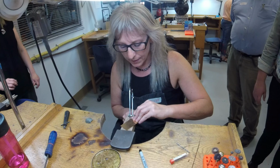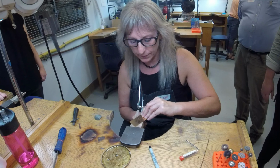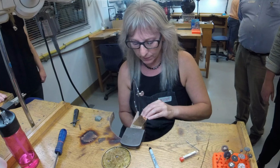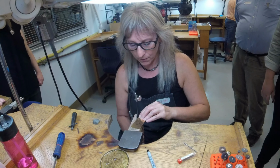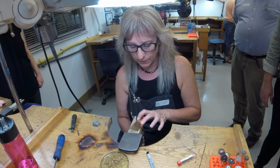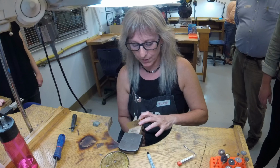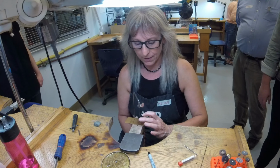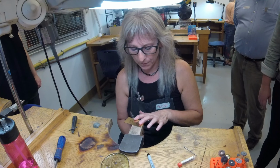So once again, lightly at an angle, barely touching the metal, get a groove. Bring your saw frame straight up and down. So now that we hit this right angle here, you're going to go up and down without going ahead. But what we're doing is we're rotating our metal. So we're just making enough space so our saw blade can go in a new direction.